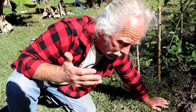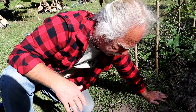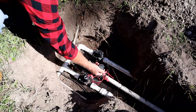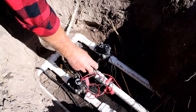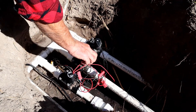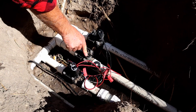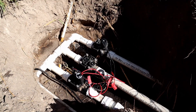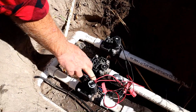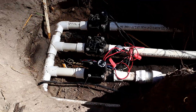I came out here when I got back and my sprinklers had been running - I don't know how long. We got back from vacation and they were still running, so probably used a lot of extra water. What had happened is this started to crack because it's about 20 years old. I was getting water spraying out all around this valve, and I went to try and tighten it up a little bit and it just snapped right off because the plastic is just rotted out. So I want to replace this valve - you can see this one looks different because I've already replaced this one.